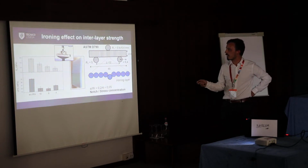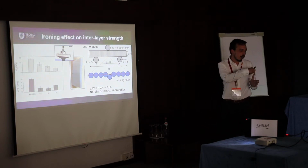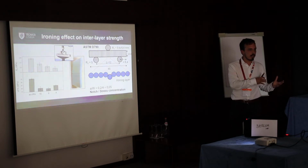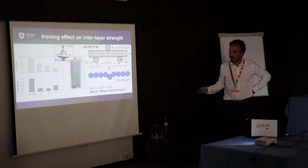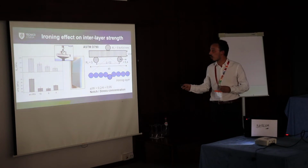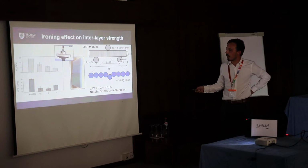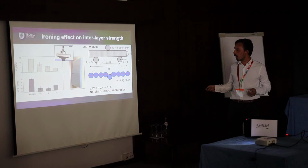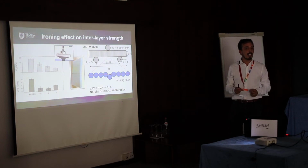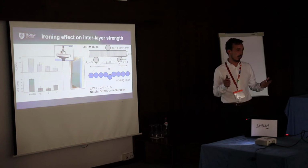One of the parameters is the inset, which is the distance between the outer perimeter of your part and the inside of your part. I selected this picture specifically because here we can visually see it. We tested a lot of different things, and even if visually we cannot see it, we almost always end up creating some sort of stress concentration location, okay?